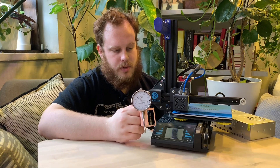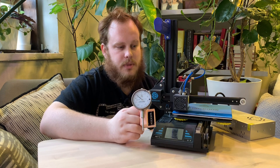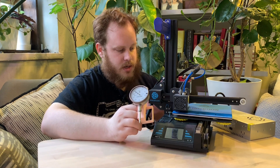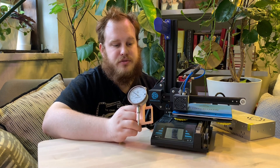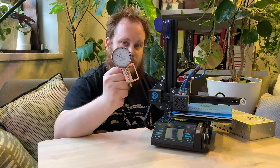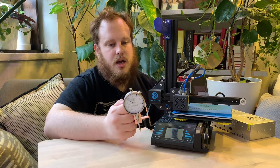So we have now leveled our printer. Hopefully this was informative to you guys. I know I did this with my artillery with a similar mount, and I've done this on this printer before and it's given me some pretty good results. You will still need to adjust your leveling every now and again, because things drift — the springs kind of lose their tension or they expand. That's just a fact of life. We'll have a link for this in the description below. You just need to do a bit of modification to get it to work perfectly on the KP3. I might modify it myself, and if I do I'll definitely link it in the comments or description with an update.